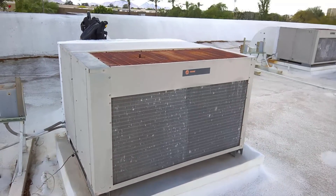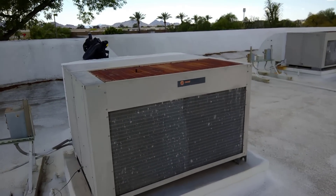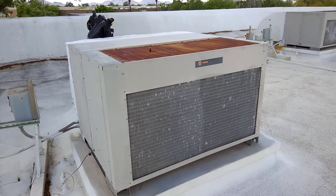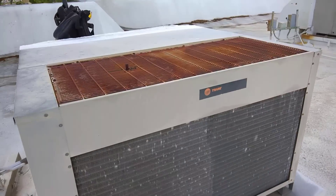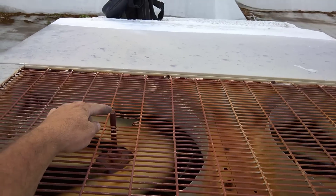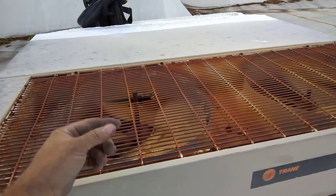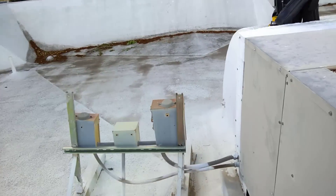These are very custom units here on this rooftop. We got these old Trane package heat pumps — these are basically off the old GE design. Trane brought them out. I really like how they leave the shafts long when they change the motors. It's really nice that way when you need to check the bearings, you just do it from right here — you can just feel the bearings' side play.